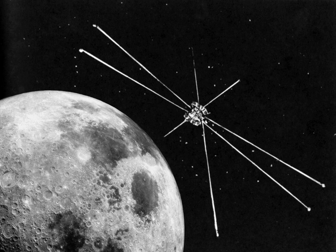Rapid burst receivers: Explorer 49 had three rapid burst receivers — one on the upper V antenna, one on the lower V antenna, and the third on the middle dipole antenna. The burst receivers were composed of a pair of IF amplifiers and detectors, one of the pair used for backup. They detected on 32 channels between 25 kHz to 13.1 MHz.